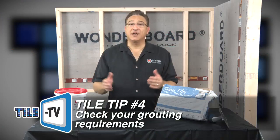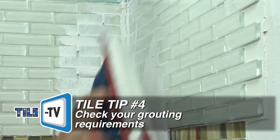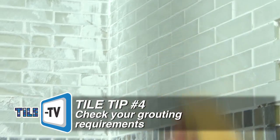Fusion Pro is a clean-as-you-go grout, so when working alone with glass tile, only grout as far as you can reach — about 10 or 12 square feet at a time. Always carefully read the instructions for all products used in order to have a successful installation.